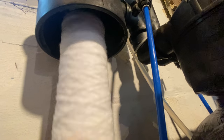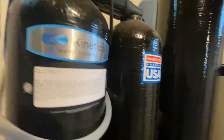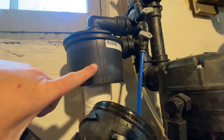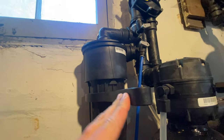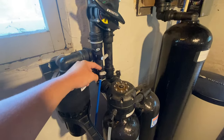To put the new filter back up in there, just line the center up with the center of the filter housing and turn to the right until it stops completely and you can't turn it anymore. Then dump out the water that's inside the sump. You'll notice there are little arrows all the way around the filter and bigger arrows up on the housing — slide the sump up and keep turning until those two arrows point at each other and it won't let you turn anymore.